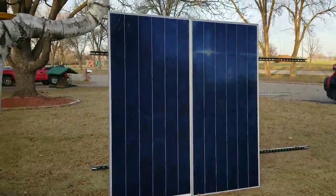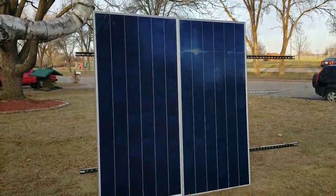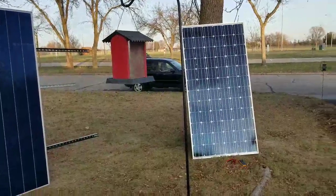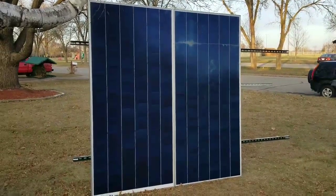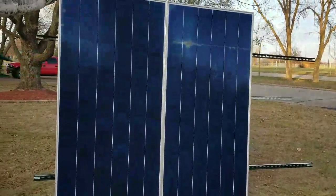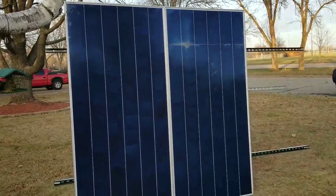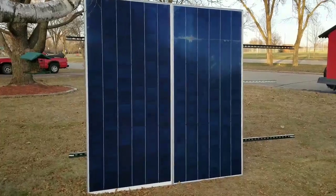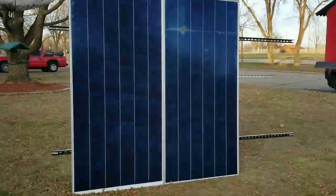These are the panels — 96-cell, 340-watt solar panels. We're going to be adding two of them but we're not going to mix them because of the voltage discrepancy. These are 51.3 volts open circuit. These are multi-crystalline solar panels with a dual function. I made a video — check my channel. We're about to cut the unistrut super strut.